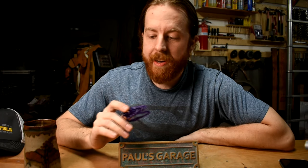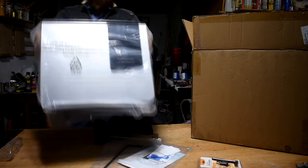Printing is one thing, and I've talked about this printer before. But the washing and curing of this resin is a whole thing. The prints look fantastic, sure, but it's really goopy and sticky. It's got wax in it, because obviously it has to melt out and burn out. It's kind of brittle. Until now, I've been taking the prints and dunking them in a bucket of dirty alcohol, letting them sit there for 5–10 minutes. Then I put them in a normal washing station which has an impeller in the bottom that makes a whirlpool of alcohol, and it just flings the prints all over the place — they're ramming into each other and the walls of the basket. That's not really good when one of the key features of your resin is crazy brittleness. And even then I have to take them out, wash them off with water, and it never gets all the goopy resin off. It's back in the bucket, and it's a whole thing.